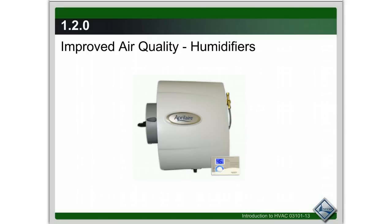There's also humidifiers. If you are in a desert climate in the dry part of the country, you are going to have a humidifier which hooks up into the ductwork. It's got a water line that comes in with it, a humidistat, and whenever the heating system is on, it's going to inject either steam or water vapor or some type of moisture into the airflow to help keep the humidity levels up in a drier climate.